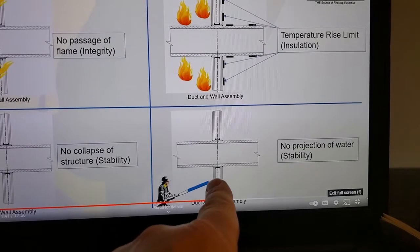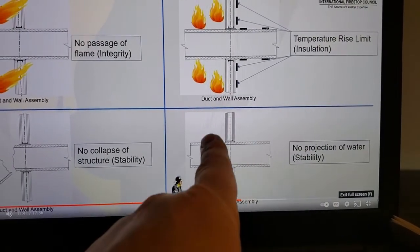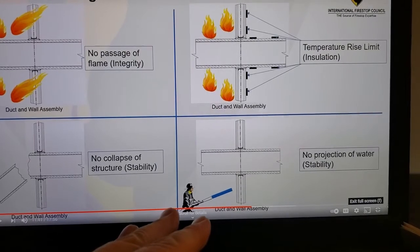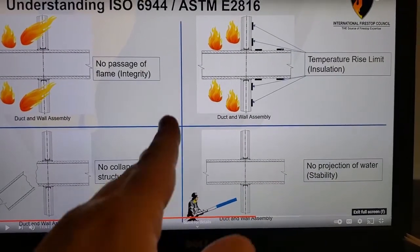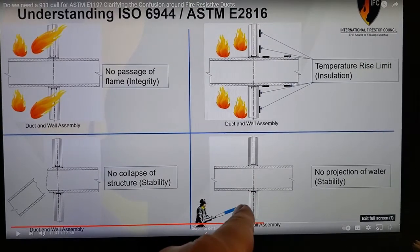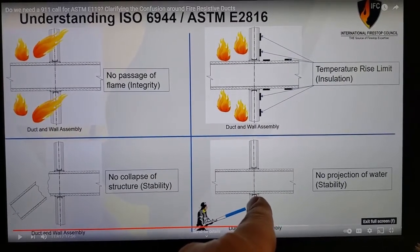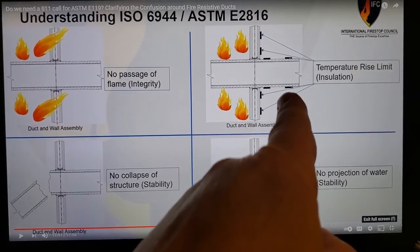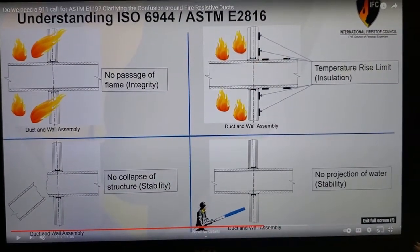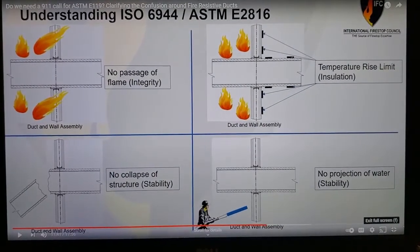And here, the hose stream, I mentioned this earlier, watching an E119 fire test, and yes, the fire stop portion of this is subjected to a hose stream. But the big engulfment sample that sits in the furnace, which theoretically should protect the fan, because otherwise this whole thing is useless, that's not getting hose streamed. The through penetration fire stop is getting hose streamed, right? So what this does is it may, for some folks, create a false impression that there is thermal protection on account of a T rating, which should apply to the whole duct. It doesn't. It just applies to wherever this duct pops through a fire resistance rated wall or floor assembly. That's where that applies. If the fan is toast, this whole thing is about as useful as yoga for hamsters.